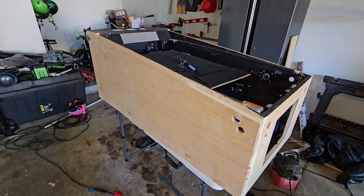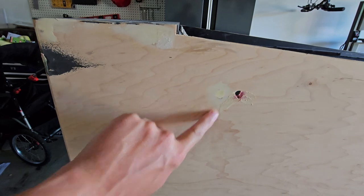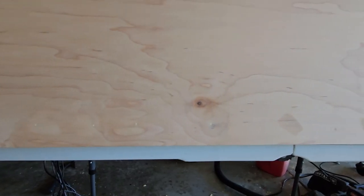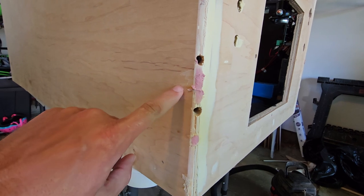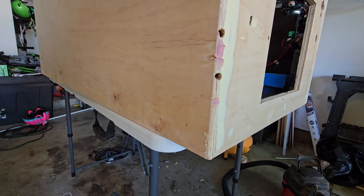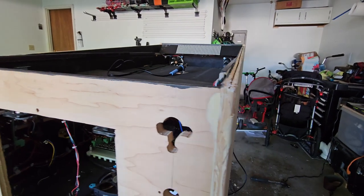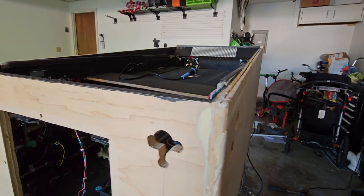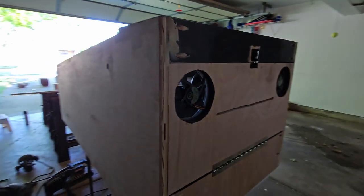Rather than bore you with eight days of wood filling and sanding, here's a 30-second overview of all the things I had to do. The last four days has been nothing but sanding and applying wood filler to fix every single little mistake. I filled all the brad gun holes — some needed to be tapped in. The first time I put my legs on I put them too low, so I had to fill those holes too. There were huge divots on both sides of the wood and a little dent from the kids. I even did the back a little bit, smoothing it out.